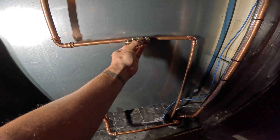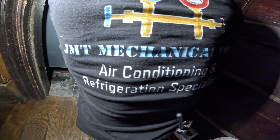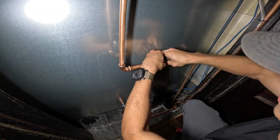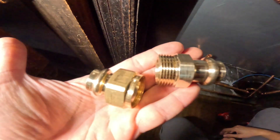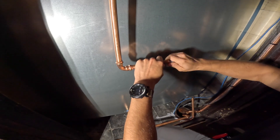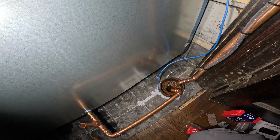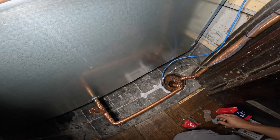Here's our union — we're going to place this in here, so we need to chop this thing up. We'll start by cutting the pipe in the center over there. That pipe is now cut, and you can see the fitting right here. Once we press this on, we're going to take two adjustables and undo the pipe so they can service the drain. We're going to sand down the pipe and debur the inside and outside. Then with two adjustables you undo the pipe and that area is free. We're going to do the same for each of those three pipes, and like that they have a full clear space to snake out that drain.